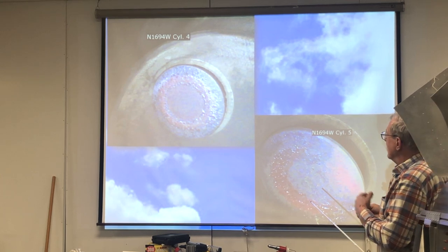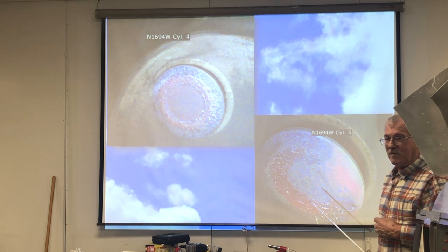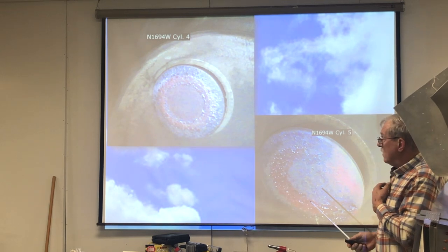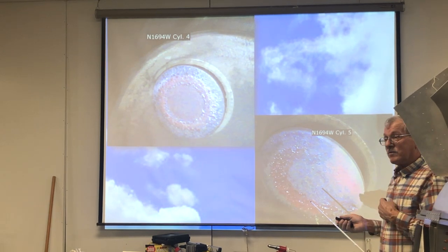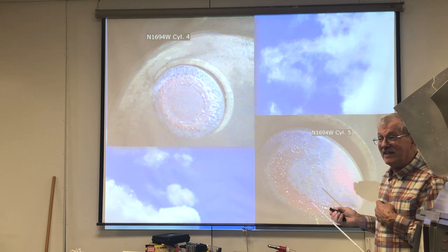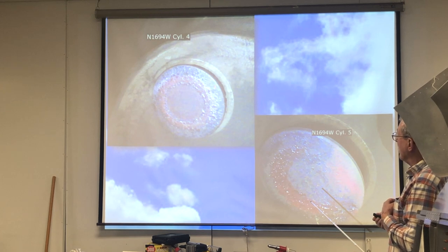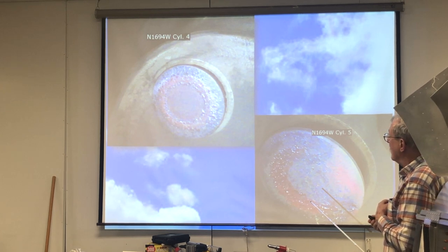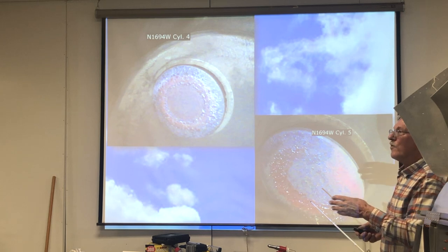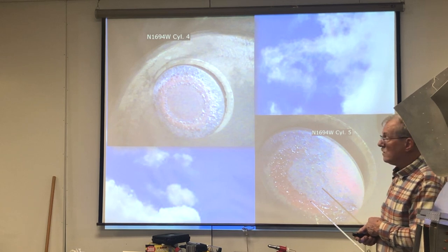So you look at your fuel flow, and if you want to go lean of peak, you make this very positive movement of the mixture control back until you get on the lean side of peak. A lot of guys think that because they're running on the lean side of peak, they can run at a higher EGT. So what they're doing is they need to apply more air in here to be able to cool the valve, but they're only going to 30 degrees on the lean side of peak, so they're still running the valve at a really, really high temperature. They're not going lean enough to make it worthwhile to save the valves.